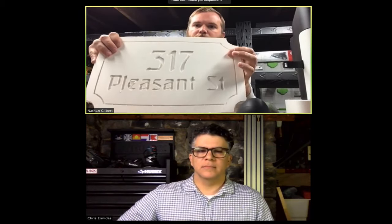There's double-sided tape on the back. Now that it's cut out, Nathan will take a chamfer or round-over bit in a regular router and ease the edges. Then he'll take a little black paint and highlight the letters and numbers so it really pops from the street. Being made of PVC, it's going to last forever. For the round-overs, he'll use the DeWalt laminate router — that new cordless one.